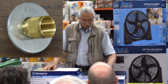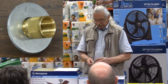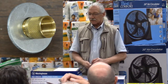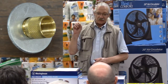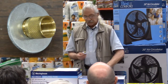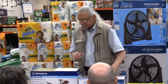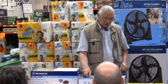How do we get those into an old box without any screw ears? If they have a center pipe for the pans, and for the hugger type, they usually come with a round hole right in the center, okay? That round hole is usually a lot bigger than the 3/8 inch pipe, so you need a washer in order to hold that bracket up to the ceiling.